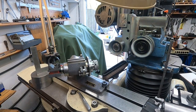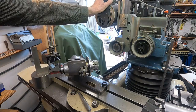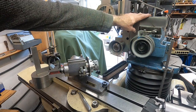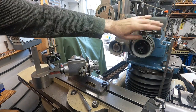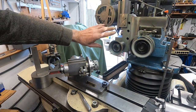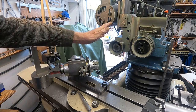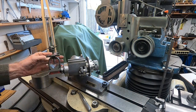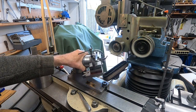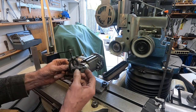Okay, I think you can see everything here. Now, I've got my shop built but precision tool post grinder mounted to the top of this wheel head here. And I've got vitrified wheels in the wheel head at this time. And I've got a diamond wheel in this. It's like an auxiliary spindle and it tilts. So I can tilt it, but I got it set at 90 right now. And I got a V-block here in the Rotadex. And I'm going to put the scraper to be sharpened in there.